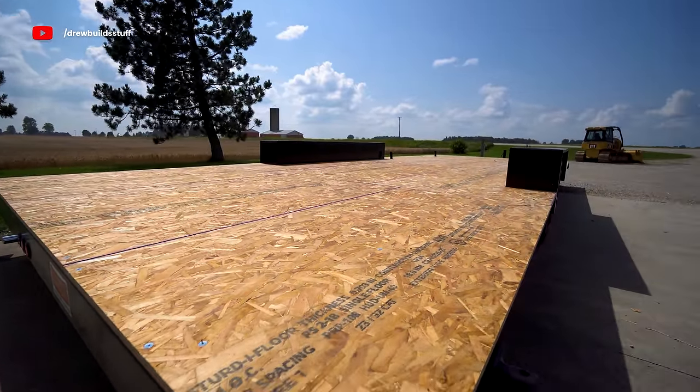One last thing in this wall, I added in these short cripple studs and then the sill plate for the window just to complete out that framing for the window. With that done, I measured this rough opening in the window and confirmed it with the spec sheet of the window probably 5 times so that I made sure this was right and I wouldn't have to fix it later on. And that's one wall complete.